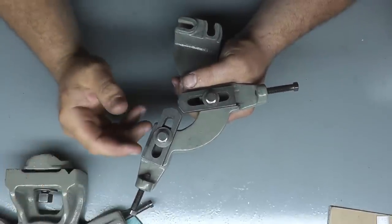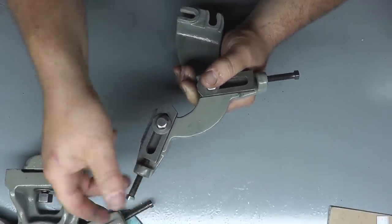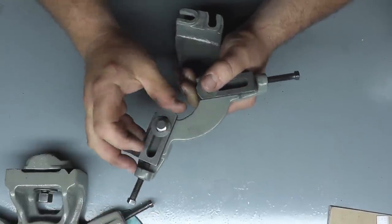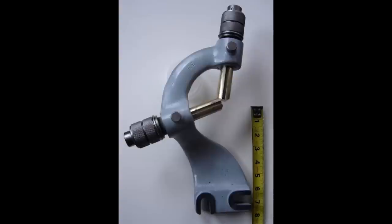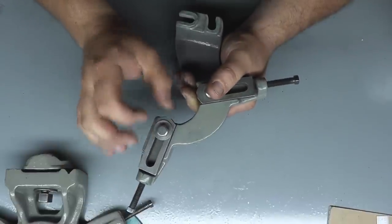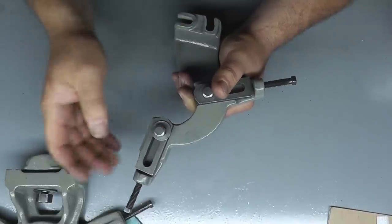Now, they also have micrometer ones, which is what Adam has if you watch his channel. Those have an actual micrometer knob that is a super fine adjustment while I move the jaws in and out. Those are a little bit better and more expensive, and they allow you to get a better feel of the jaw on the part. To get the right tension on the jaws, we'll be using a feeler gauge so we're not rubbing directly on the part. I'll show you that.